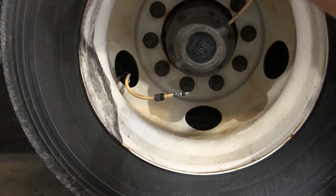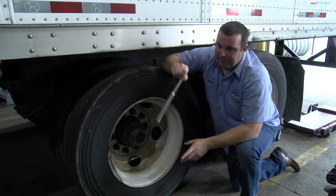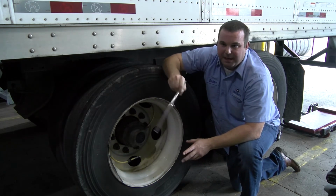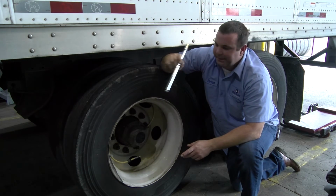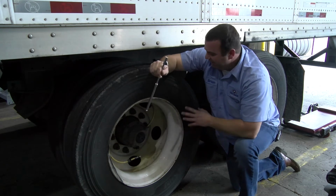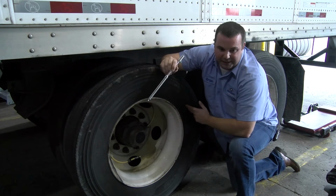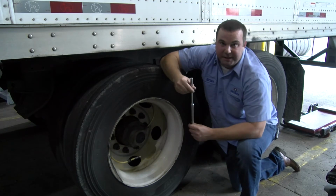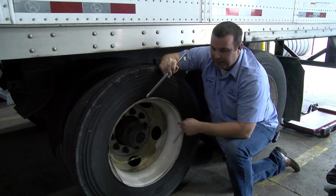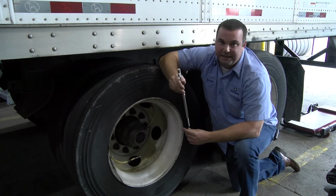All right, so we're going to hit this in. All right, and we're going to show that we actually have 56 pounds of pressure in here. All right, now one thing that you got to remember, USA Truck considers a tire flat at 88 pounds of pressure. Okay, that means that this is, by USAT standards, a flat tire. All right, and that's 20% of the maximum air allowed in the tire. All right, DOT is actually 50% of air applied in this, or amount allowed into this tire. That's going to be considered a DOT violation. All right, so even by the PSI that we just found in this tire, they are going to consider this tire flat. That means this trailer cannot roll, cannot drive. All right, you are in a DOT violation.